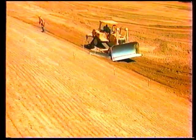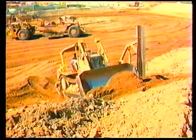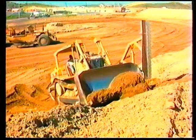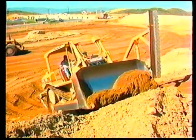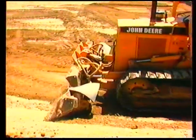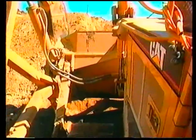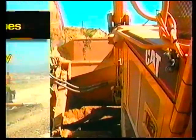The kind of equipment typically required for this type of operation is a small finish-type dozer, CAT D5 or smaller, which will generally have a lower center of gravity and provide more stability while working on a slope. Usually, a smaller machine will take a higher level of skill to operate it efficiently. The operator must have a keen eye to see grade while in the seat.